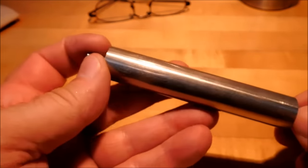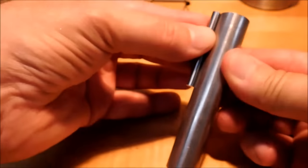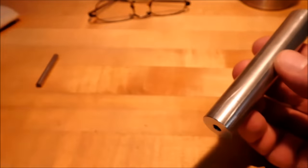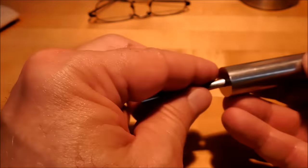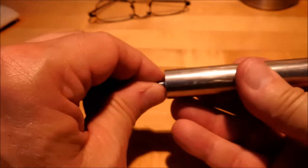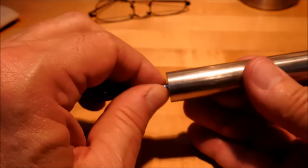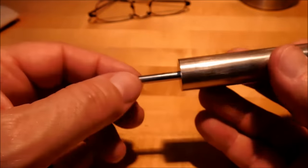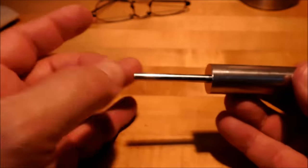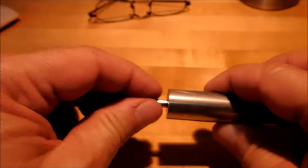You can feel where the holes meet, but still, you got to believe, for a hardened .201 diameter pin, the hole has to be tracking straight in at least 2-inch increments in order to get that through. You're not going to bend that pin. .202. Little bit right at the very tip, and I can tell you that that's the first bore pass that I did on the first side. So .202 goes in there and just sits in there ever so gently. This side, no bueno, not happening.